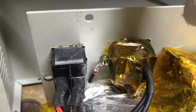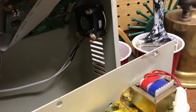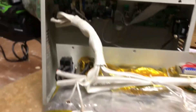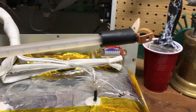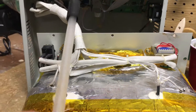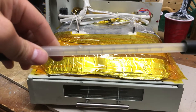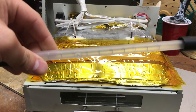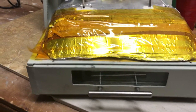So after this Kapton mod, the only other thing I changed was grinding away the paint where the ground is. Eventually I want to upgrade — these are sealed halogen quartz infrared heating elements, and they turn on instantly, whereas the ones in this T962 take a little bit to turn on. I'd like to upgrade with one more of these and see what happens, but for now I just want to get the bone stock version working.